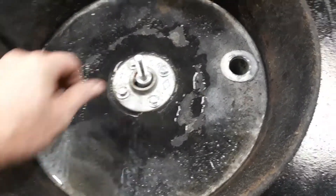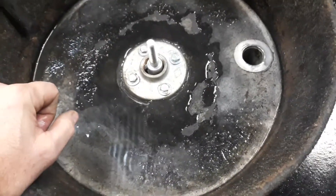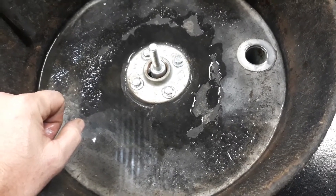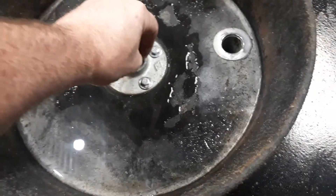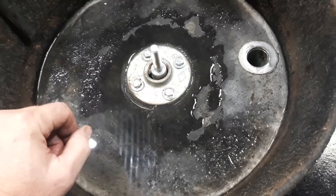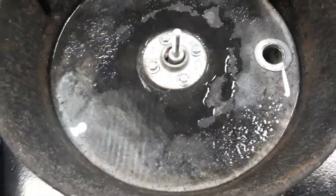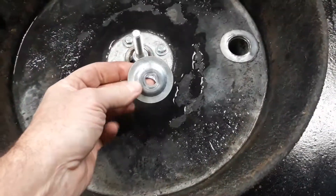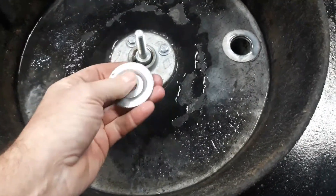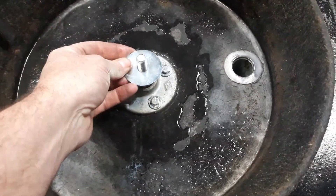Only two or three pieces I actually bought. This here is a half inch arbor meant for converting a motor over to a buffing wheel. It's got a half inch female on one side with a couple of set screws, and half inch arbor thread on the other side. I put it on and was surprised — it was relatively true. I checked it out with a dial indicator and it ran relatively true, so I was happy with that. It did come with concave/convex conical washers, but they wouldn't run true at all. I tried several different ways of getting them to true up, so I gave up on that and just went to a plain old half inch fender washer.